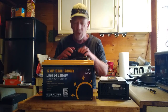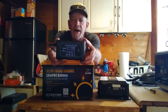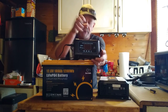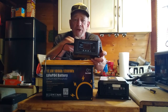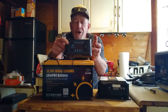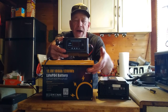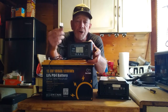If you can't use solar panels, you need a charger. This is a Joybot 20-amp AC-to-DC charger with alligator cables — just like jump-starting a car — and an AC plug on the other side. All you do is plug it into your AC outlet, hook the clamps to the battery, and recharge it. With a 100 amp-hour battery and a 20-amp charger, divide 100 by 20: it takes about five hours on AC to recharge from empty to full.